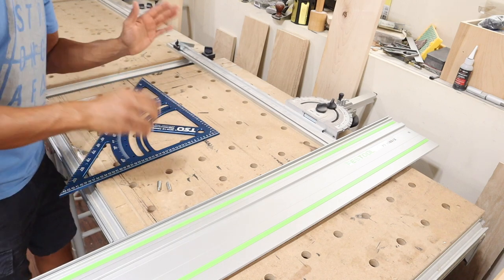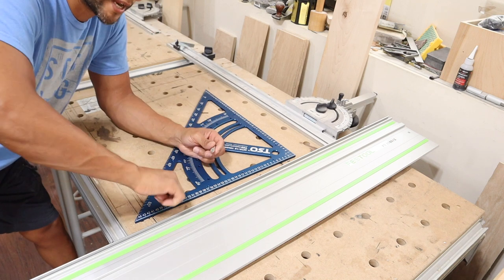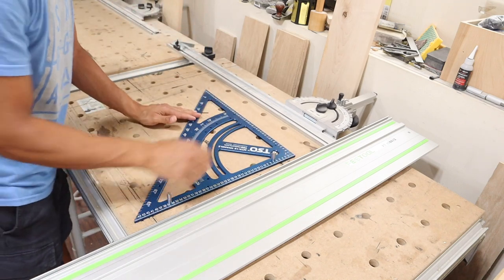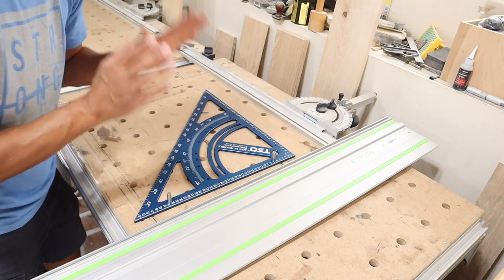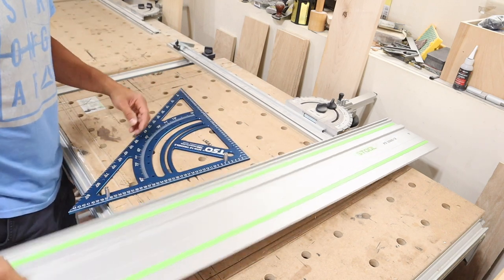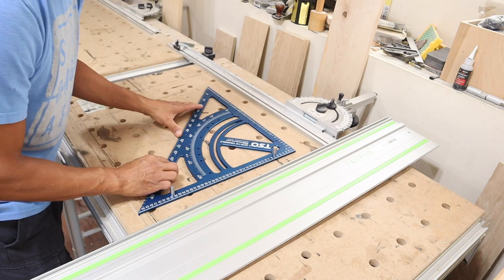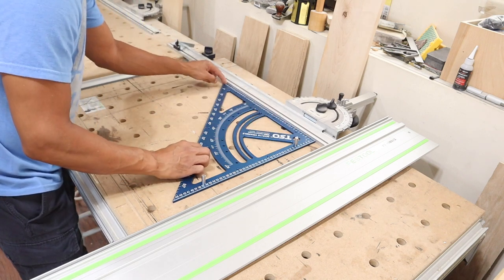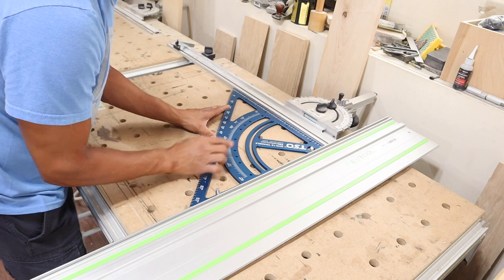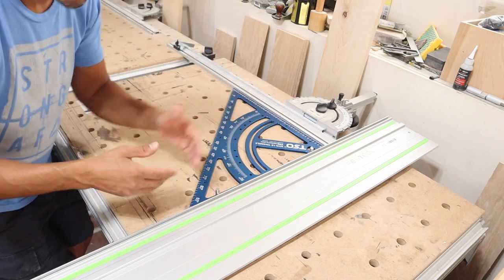My number one favorite use of this triangle: these two tall pegs screw right into the threaded inserts on top of the triangle — just get them snug, don't over-tighten. Without these pegs, the triangle would just slide right underneath your rail. Now I have my rail down in place secured in the pin, and my fence set to 90 degrees. I butt it up against the back fence — no light, no space, dead flat. I slide it into my MFT Festool rail, hitting the rail and the back fence, and wiggle it slightly. Now I know I am 100 percent at 90 degrees on this cut.